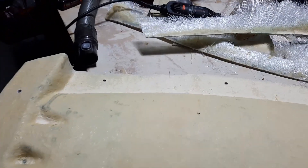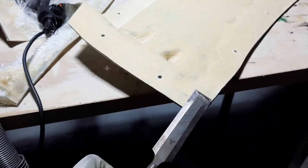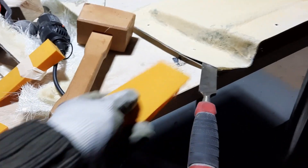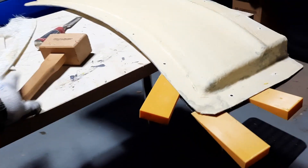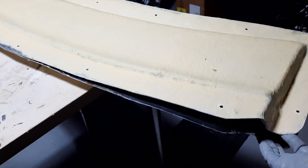Discarding the flanges, you can see the finished mold coming together. The next challenge is splitting those two layers. The trick is to look for that little hairline crack between the two layers of gel coat on the upper and lower surface, and to drive in a chisel. I've got some cheap 3D printed wedges which I'm tapping in and chasing that crack all the way round the perimeter of the part. Due to the complex curvature of that spoiler it takes a little bit of extra effort to pull the parts open, but once you have it, it's ready to rock and roll.